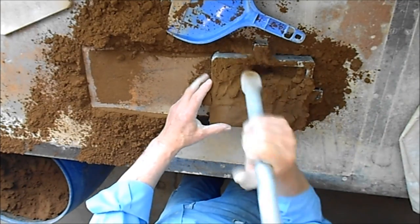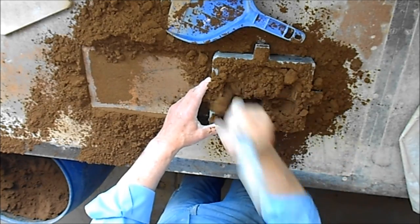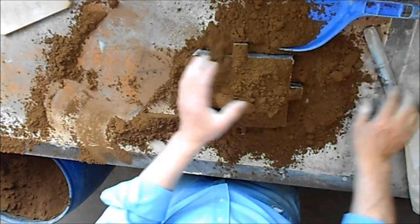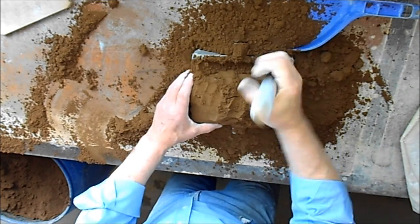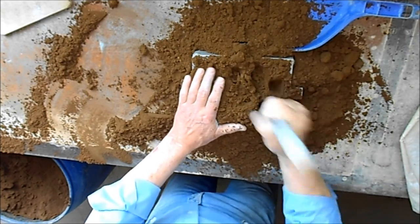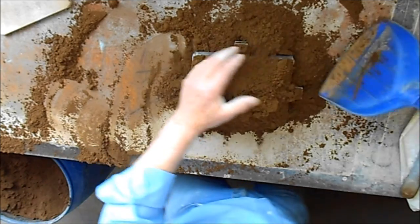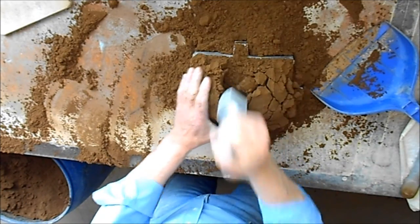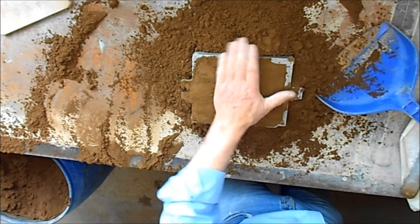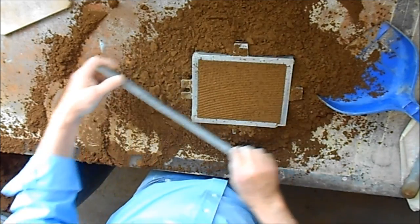Round the outside, fill in the middle. Again around the outside. These are only little boxes and they do ram up rather quickly. They're all much more fun to make after some of the big ones. Strike that off level with my trusty old power hacksaw blade. Leave that a little rough at this stage.